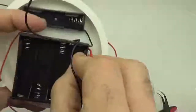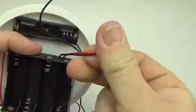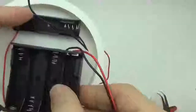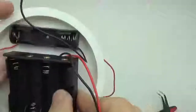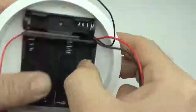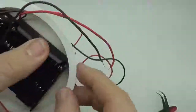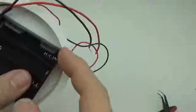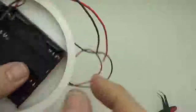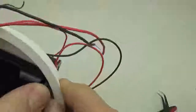And does the orientation of the second 4-pack matter? Yes, the orientation matters on all of these. So you can see where the leads are coming out. When we join everything together, we're going to put a diode in there to isolate these battery banks, but the orientation does matter. And even leaving a little space, I didn't quite leave enough there, but occasionally it's nice to run wires around, so we're probably going to have to shift that. Unfortunately, I've already put it in place, so we'll just have to squish some wires there.